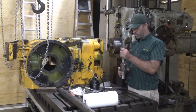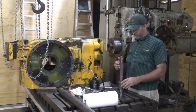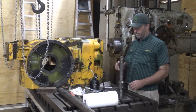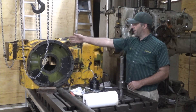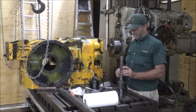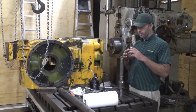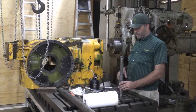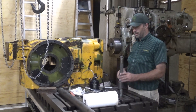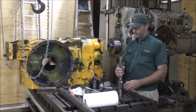This was the best tooling setup I could come up with for doing this. This just barely gives me enough length to get to the bottom of that bore to recut it. With this tool, it's got to go through bearing pockets - the four inch spindle can't pass through them. But this here will go through and just barely gives me enough to get down in there. So this is what I'll be using - this inch and a half bar with a high speed steel ground cutter.